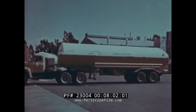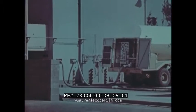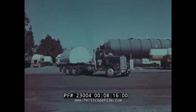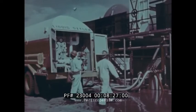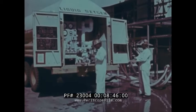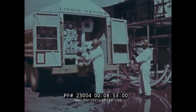Now with these basic rules in mind, let us see how LOX is received. Liquid oxygen or liquid nitrogen will always be received directly from the generating plant, its storage tank, or from a mobile container such as this transporter. No matter how the LOX or liquid nitrogen may be received, the transfer procedure will always involve the same necessary steps: the transporter must be properly grounded, a prepared checklist covering all safety and standard operating procedures will be followed, and a minimum of two men will be present whenever LOX is transferred. Both men will wear the required protective clothing.